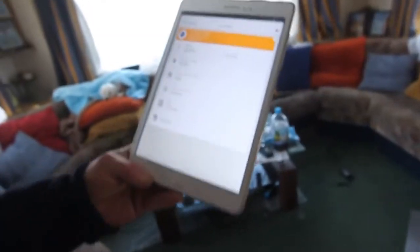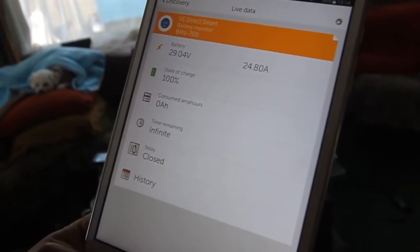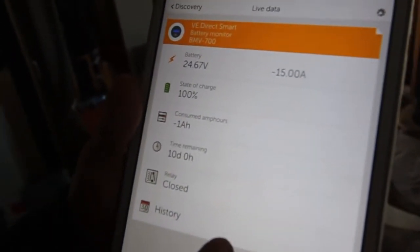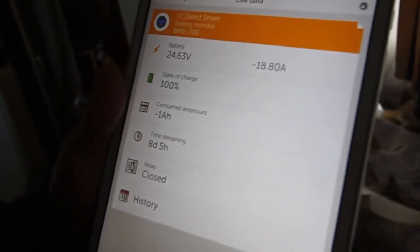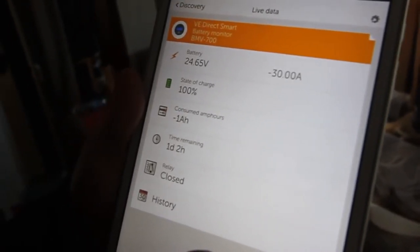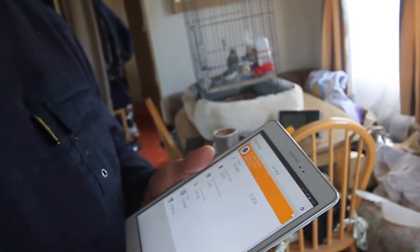Washing machine! It's up to 23 amps, 21, 20 amps charge from the battery and solar. Battery voltage 28 volts. The washing machine takes 140 amps whenever the immersion heater kicks on — that's probably 125, 130 amps — and overload alarm. Victron will go into overload 3 times and that's it for him, you need to restart manually.